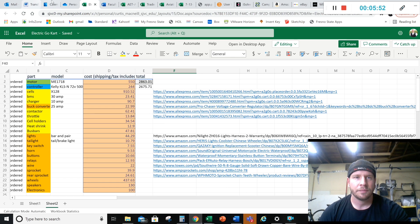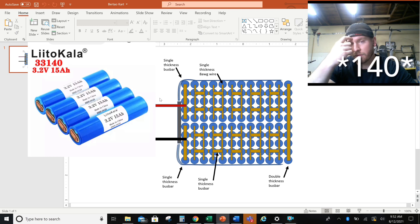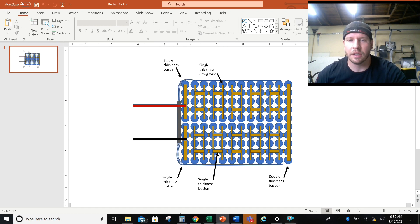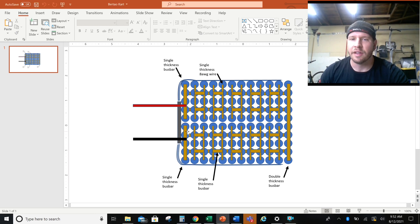The battery pack uses lithium iron phosphate cylindrical cells - 33mm diameter, 130mm length, each containing 15 to 17 amp-hours. Averaging to 16Ah, we're looking at an 80 amp-hour pack. We'll run 5 in parallel and 24 in series. The parallel connections will be made with 8-gauge bare copper wire, straightened out and soldered down to the tops and bottoms of each cell. The series connections use copper bus bars with a cross-sectional area equivalent to 6-gauge wire, giving close to 2-3 gauge combined capacity.